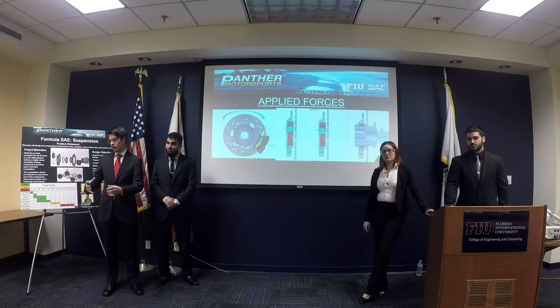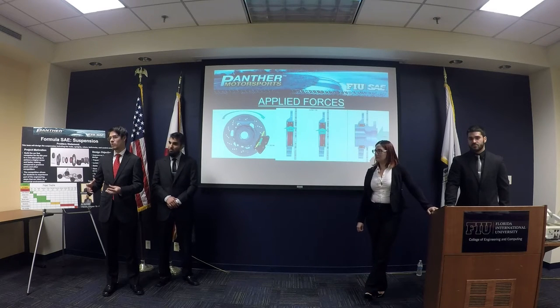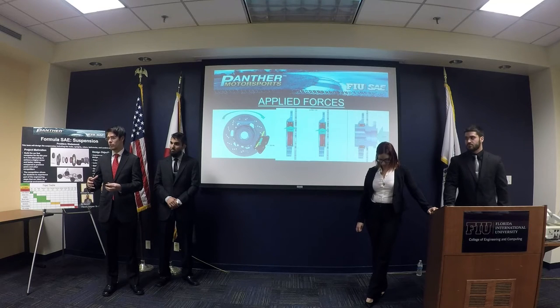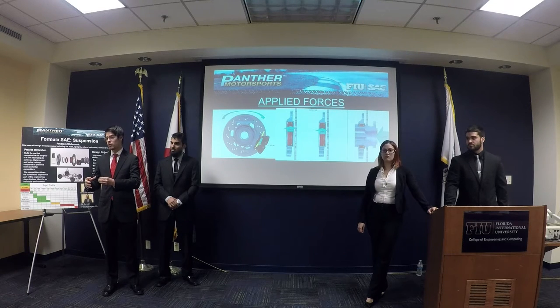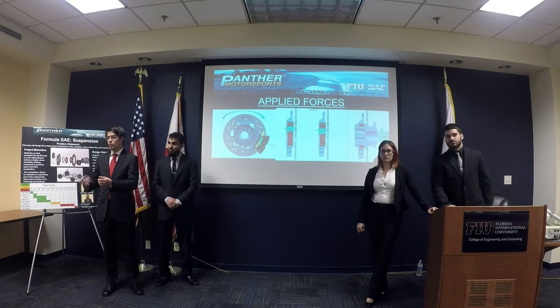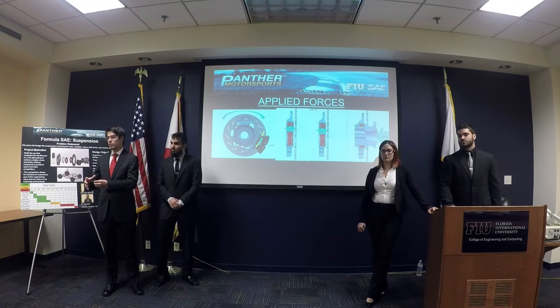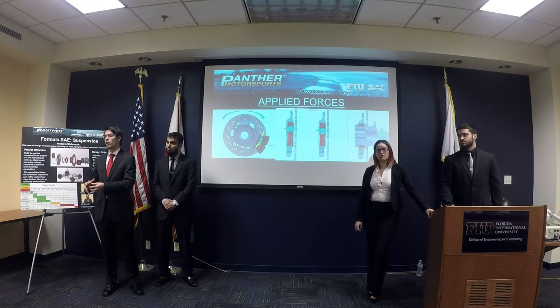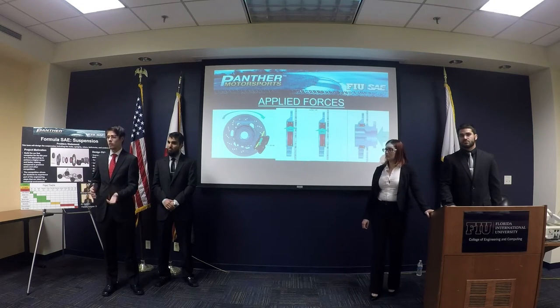Right, as far as when you say there's two materials that maybe you have an issue with, maybe the hub, right? The hub's made out of aluminum, and in this case, the shaft is made out of steel. We did notice this, and we did notice that there might be a little bit more wear than could be anticipated, but we did think about that. And as far as expansion rates, if there is some temperature, it's still not to the point where it will lock. So we did take into account all that.